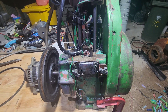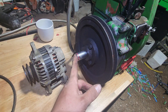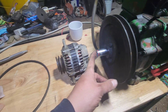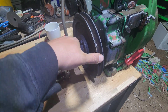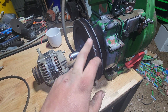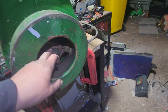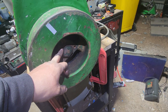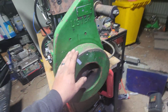I was starting it with a socket and a big hammer drill — spin it with the drill to get it to fire up. It's a two-person operation at this stage. I need a better way to start it because you need a lot of torque on this two-to-one side. I'm thinking I might find something to drive that monster of a nut, or wrap something around the flywheel and spin it to get it going.